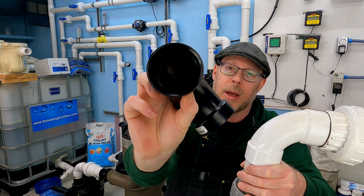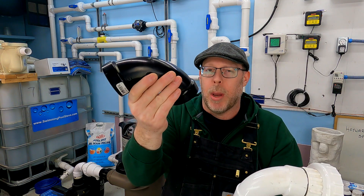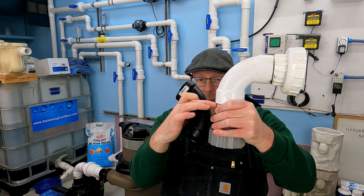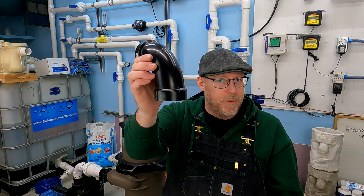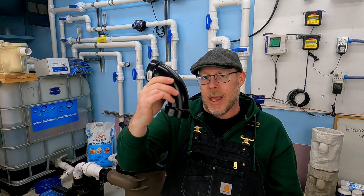Here's a tip on how you can tell. Remember those two 90s? They look really similar until you start to look at the glue slip length — that's the part inside where the pipe glues. Look at the length of those in comparison to each other. This one is barely half the length of glue slip compared to this pressure-rated PVC fitting. That's something I look at all the time when people send me pictures of their swimming pool installation. One of the first things I check is the length of the glue slip, making sure they're all about one and a quarter to one and three-eighths inches in length — that's a common length for a pressure-rated PVC glue slip. Around five-eighths of an inch is maybe common for a non-pressure-rated ABS connection.